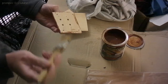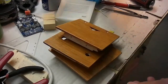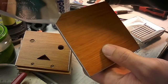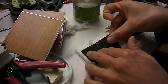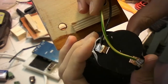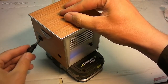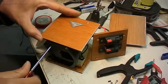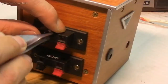The wood was already covered with a coat of transparent stain, so I needed to add several coats of colored stain for the final look. First I used brushes, but then I switched to a piece of sponge, and that made a much more natural look. Then I spray painted all the areas where I wanted to have a silver finish — all the edges, the decorative pieces and the grilles. At the front I had an unwanted spot, but I could remove it with alcohol as the paint was not completely dry. I glued a black material to the back side of the grilles. For the battery terminals I used some copper strips. A foam piece applies pressure to the contacts, and I started wiring up the things. The ground terminal of the three-legged DC socket connects to the third leg when no plug is inserted. This is the final assembly. As a final touch I labeled the ports.